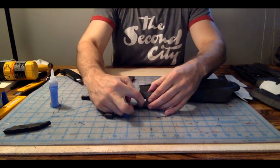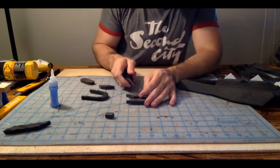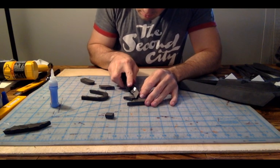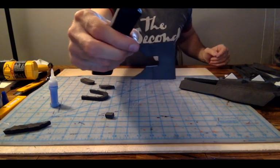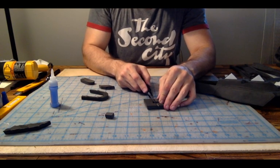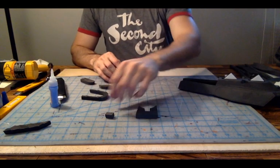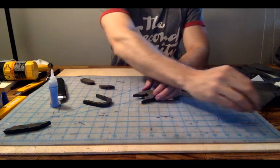It's got a groove that you're going to cut right inside the middle there. So I've marked it off. And do a little less than a quarter of an inch cut through on that. You just want a little V, just for detail. And that's midway through where that little accent piece would rest. Save our little recess area. We're gonna save this piece off to the side for now.